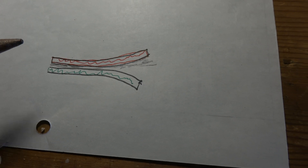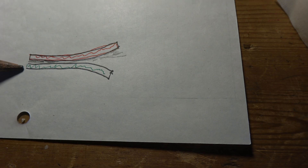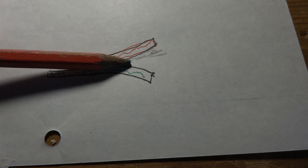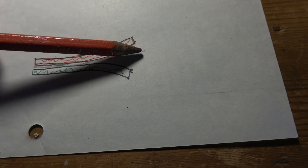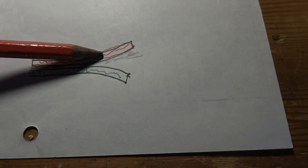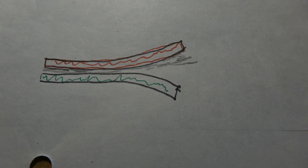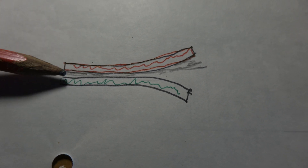What makes it hard is the panel is wired up with these flat copper strips. It looks like there's just one if you try and look through the panel, but basically it's made up of a positive strip and a negative strip separated by insulation in between — it really does just look like one strip of metal. But if you dig a little thin screwdriver into the end it'll pry off and you can see it's actually two conductors, a positive and negative, separated by some plastic insulation in the middle. It's a bit tricky to dig into, but it can be done.